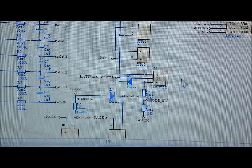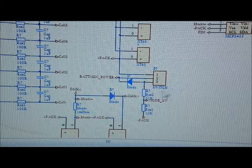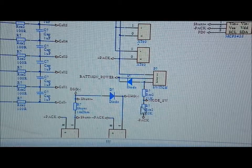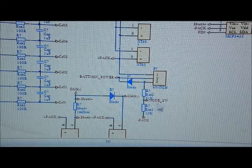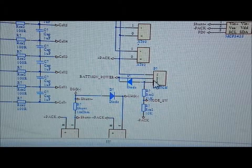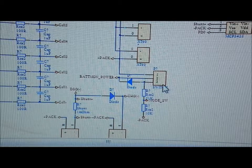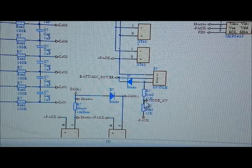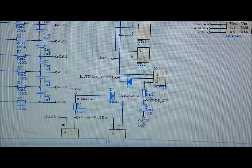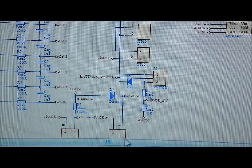You have to be careful about things like resistive dividers — this one here will slowly drain the battery if you accidentally leave the switch in the three-position. I could do it with transistors but that adds a heap of components. I might not even use the three-position key switch yet since they're quite expensive, but the option's there. And drawing very little current, the odd chance of leaving it on for a day or two won't really be an issue.